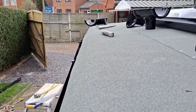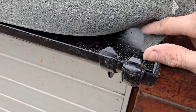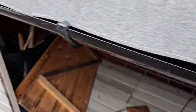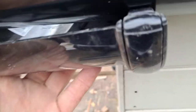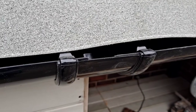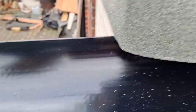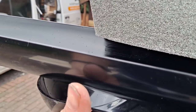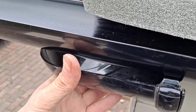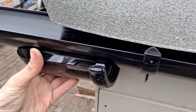I've adjusted it and brought it in a little further — it was just caught on one of the bricks. Now it's all correct and up to the line on both sides, so it has a good seal. Now we need to set the corner up. What we're doing is attaching a piece of guttering to the corner piece to get a rough idea of where to put it — it doesn't matter if you cut it too long because you can always trim it down.